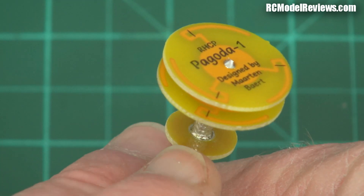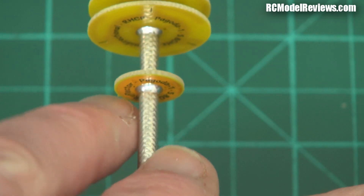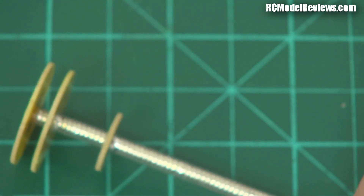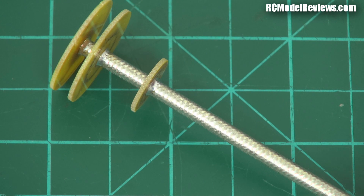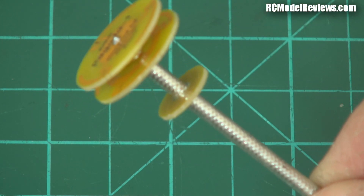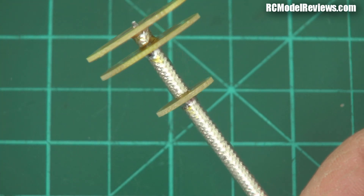There's also a little disc down here at the bottom — I suspect this is a balun or a choke to stop the coax from radiating. One of the problems with a lot of circularly polarized antennas is that they're not perfectly balanced, so you get current flowing in the screen of the cable which can upset the axial ratio — the cable itself starts to act like a linear antenna and radiate. I think what Martin's tried to do here is reduce that effect with this piece at the bottom, since both pieces are connected to the screen of the coax.